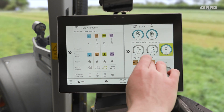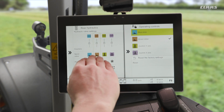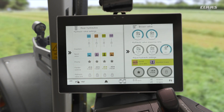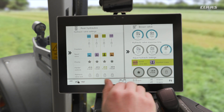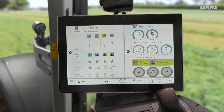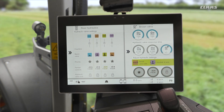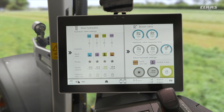Underneath that I can change how my valves are controlled. So for example, if I wanted to change how my machine was connected at the back rather than having it plugged in on the brown valve, I can now control it on the X-axis of my joystick. I can allocate priority to this valve — so if I had a fan of a drill plugged in, I can assign that valve to be controlled by the fender controls of the machine — and I can individually lock off that valve if I don't want any function to it.